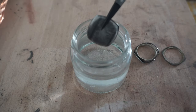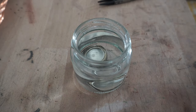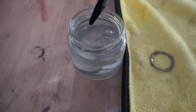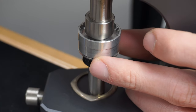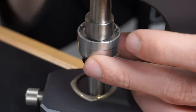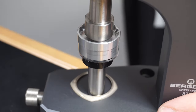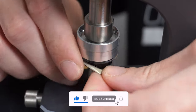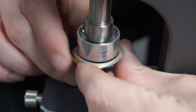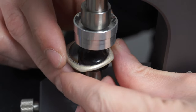The beat error result is not great so we'll work on improving that. First I'm focusing on the case — putting it in a silver cleaning solution just to remove the oxidation and have a cleaner look. I just don't want to polish it because I want to keep the original look — I don't want this watch looking like new. Now fitting a new crystal — the old one was yellow, cracked, and not good. I'm using my press-fit tool to compress the crystal so its diameter becomes just a tiny bit smaller, allowing me to bring the case in and fit it in the groove. Then releasing the tension so the crystal expands in the groove and is trapped in the case.